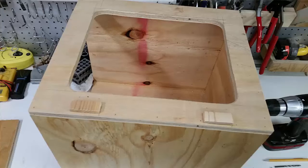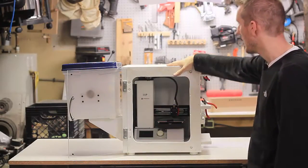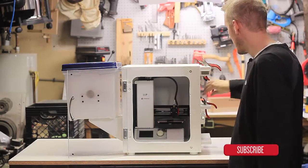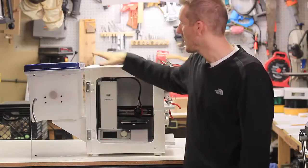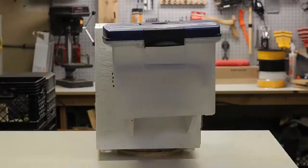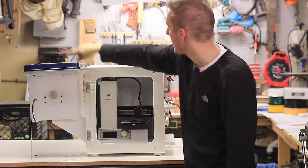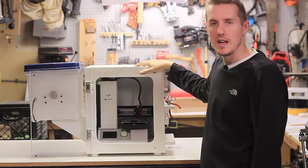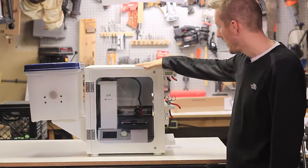Overall, it's 5/8 inch plywood — I used about half a 4x8 sheet, so a 4x4 foot piece should be enough. I cut it all on the table saw, glued it together, and used an air nailer to secure it until the glue held, then glued on the foam with spray adhesive. I painted everything up and I really like how it turned out. I feel like it's as small as I could have made it. I could have put the filament on the top, or made the dry box a bit smaller, but overall I'm happy. Since I don't plan on using ABS, I probably won't add the exhaust fan.